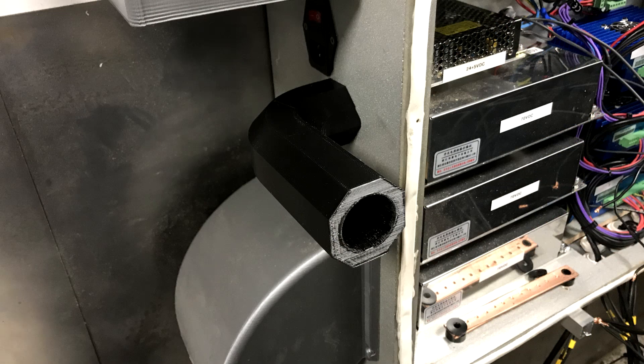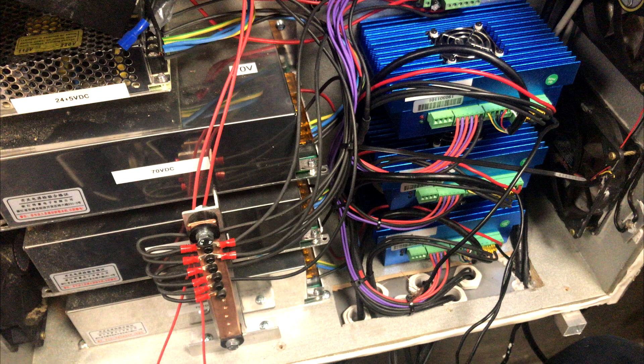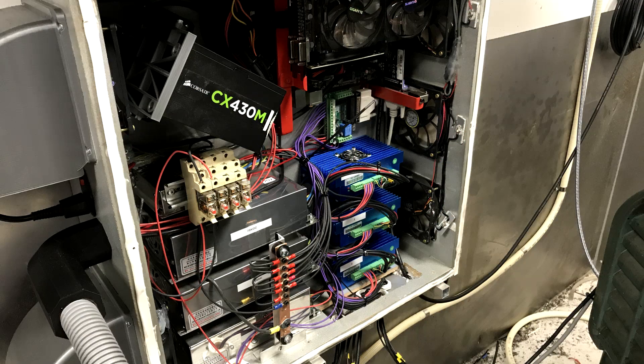Next was a 3D printed elbow — the bend is really too sharp when running wires, but hindsight is always 20-20. After getting some tips from forums, he decided to connect all DC grounds to a collective point, which is the copper bus bar set on a plastic bushing. This should make sure you don't get varying ground voltages. A stack of relays was also added so he could control some high voltage features from the control panel without actually having to run 230 volts to it.